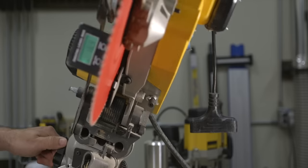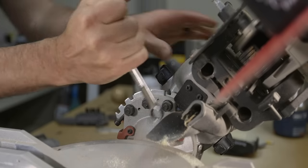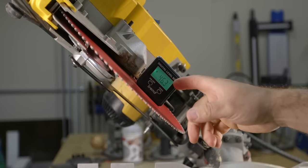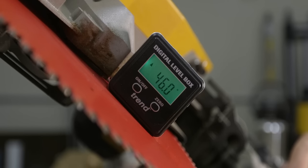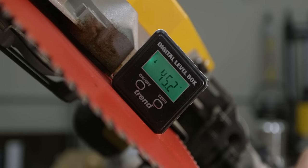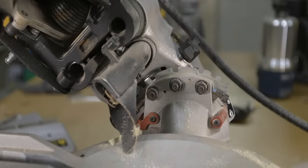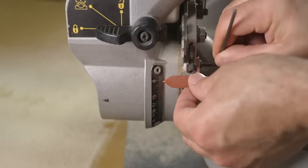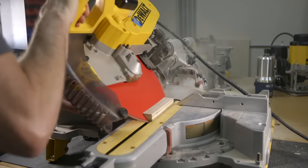After making a test cut and verifying that the 90-degree is good, we can move on to look at the right and left side bevels. With the angle finder zeroed out on the blade, tip the saw to the right and lock it into the 45-degree detent — this side is looking really good so we can tighten up the right side nut. Moving on to the left side, we can see it does need adjusting. On this saw there's an allen screw that acts as a stop similar to the bolts on the Hitachi; adjust it in or out until you reach a reading of 45 degrees, then lock it in place by tightening the last nut. Because we already adjusted the 90 and now the 45, all the other angles in between should be good. Double check to see if the other dial indicator needs to be moved after making these adjustments, and make two 45-degree bevel cuts to check them with your square.